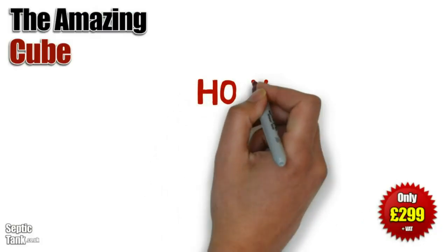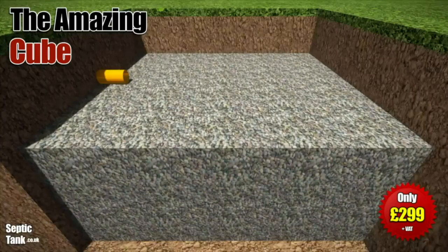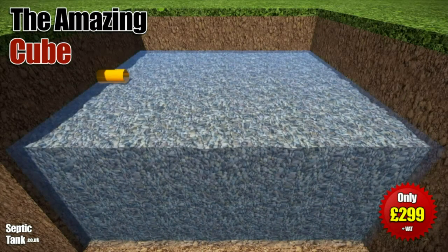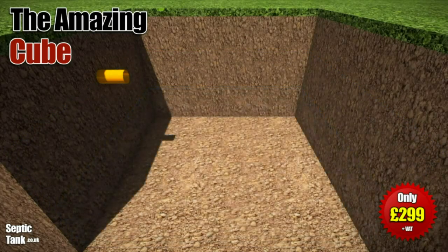So how does the soakaway pit work? Well, it's a very ingenious but simple design. The gravel pit fills with liquid from the cube septic tank, and it fills up to a certain height and then drains naturally away back into the soil.